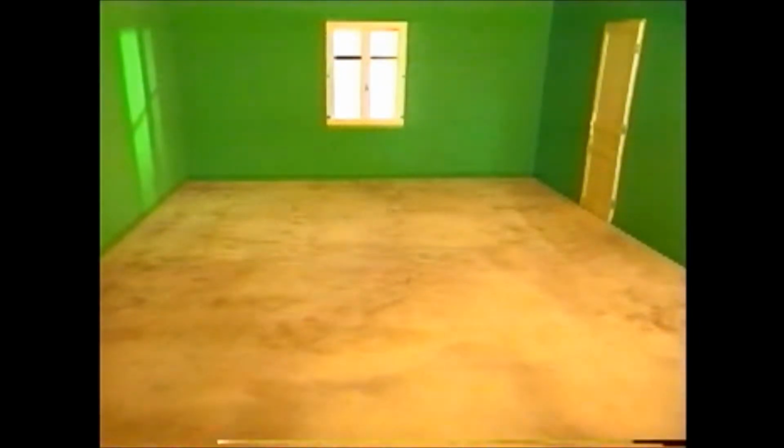Consider the position of the doors and windows. The sheets will be preferably laid in the direction of traffic, often lengthways down the room, or in the direction of natural light. If a choice is to be made between the light and traffic, opt for traffic.